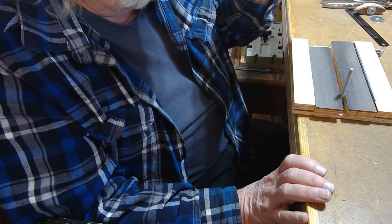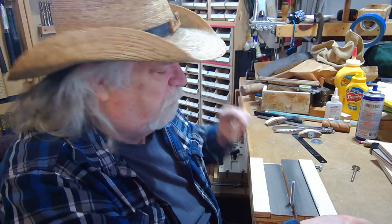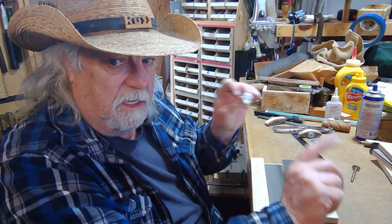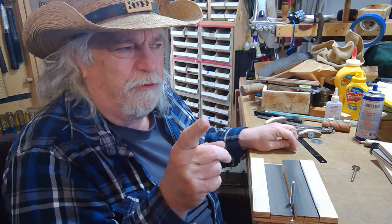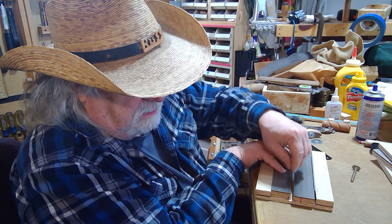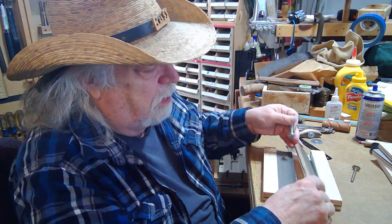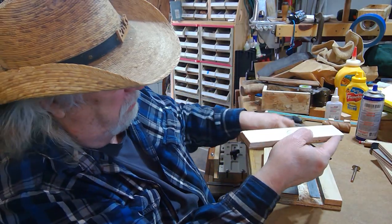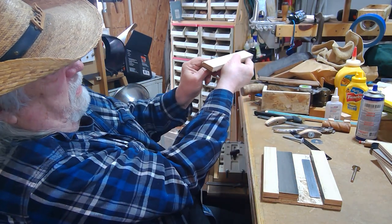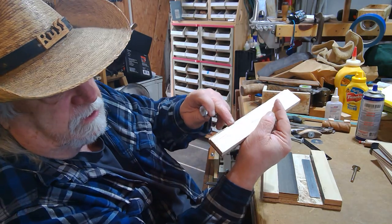So you can set this up to work with carriage bolts if you want. Personally, I would not use carriage bolts unless that's all I had at that moment. I would avoid carriage bolts as a general rule and just stick to making my own. There's another way you can make these if you don't have a slide T-nut — you can make it from pretty much regular material in your shop. That's how, by adjusting this upper slot closer, you make the bolt fit in there tighter without changing how the bolt slides in the bottom.